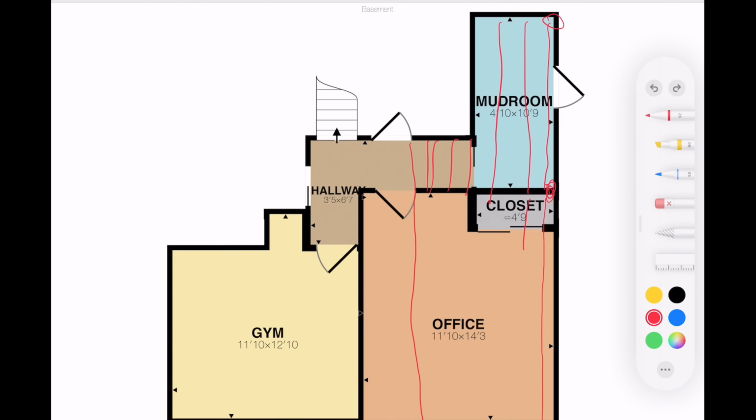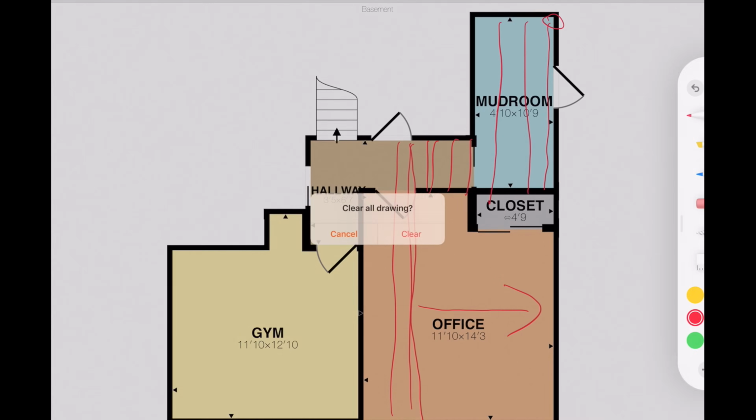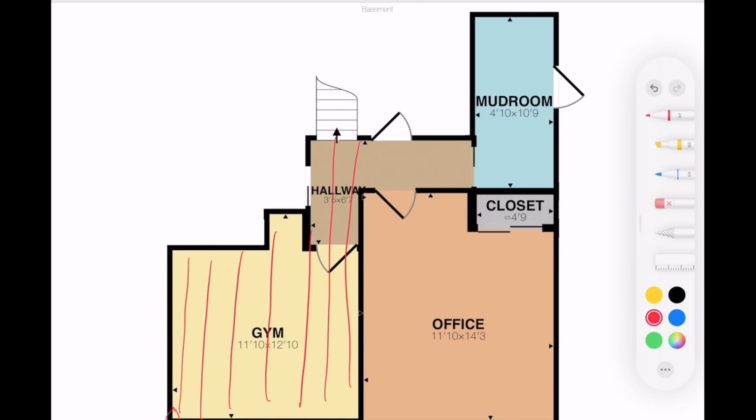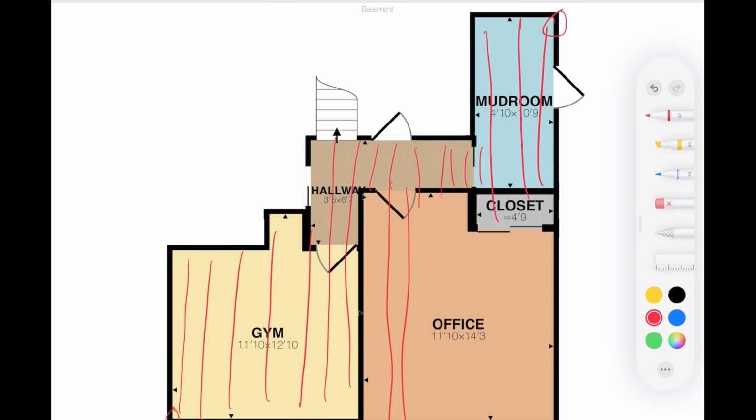So the safest way, if you are going to do it that way, is to work your way backwards. The alternative is if we start in this corner, we start installing boards, and then we go through this hallway, we come here, and then we have some boards there, and then you can go down and you can finish here, and then you can keep coming down here and finish here. So we only have to work backwards that little area right there. Let me give you another example to help you visualize this.